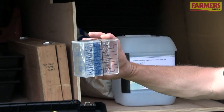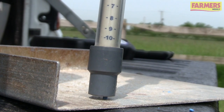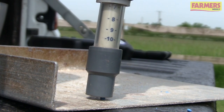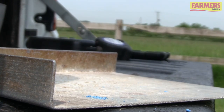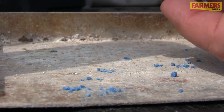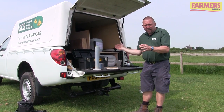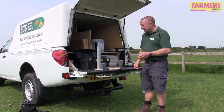The third measurable characteristic is strength. We use the strength indicator and a push strength of 8 is where we'd expect the pellets to be. Good strong pellets will withstand a lot of force as the disc comes round with the vane and gives it a whack, propelling it to a decent width.